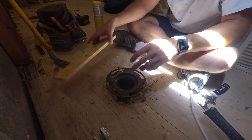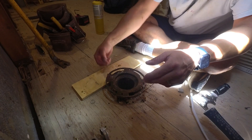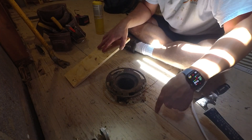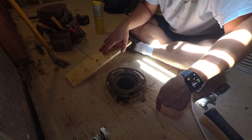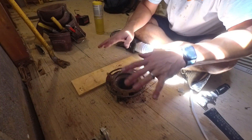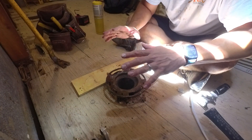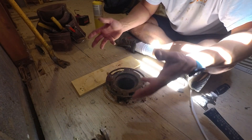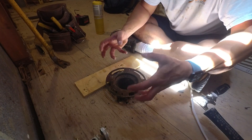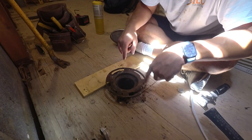I have a little scrap piece of plywood because I'm going to start prying this flange up. This old plywood is kind of weak - it's only half inch plywood. This is a sixties-built house and they go so cheap on two-by-fours and plywood - it drives me crazy. But that's the history in this house. I'm going to have this plywood in place once I heat it up again, and the heat's built into it a little bit. So let me start heating it up more.